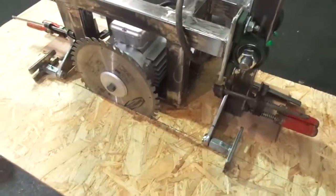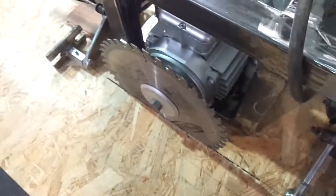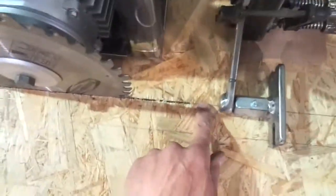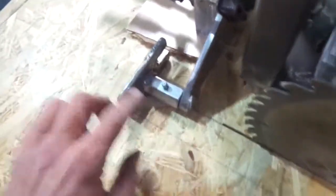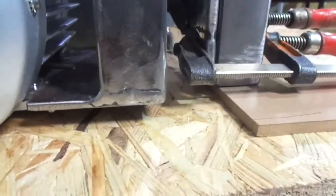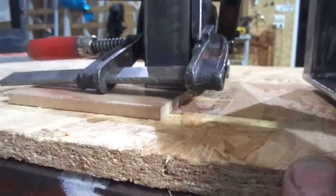Here is my method to align the tilt hinges. It's basically a board with a slot in it so that I can stick the saw blade through. Here is my center line, and this is how I align my hinges with this center line. I also left myself a little bit of leeway so that I can swing the saw blade a little bit beyond 90 degrees.